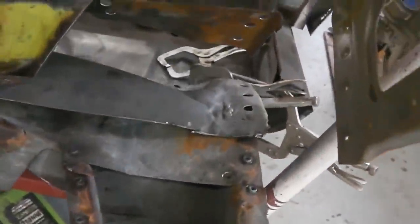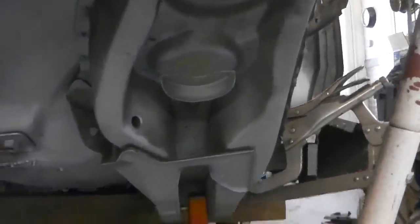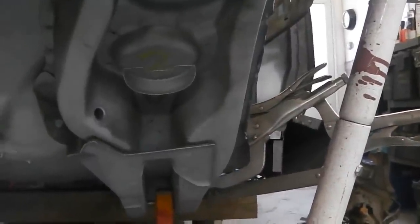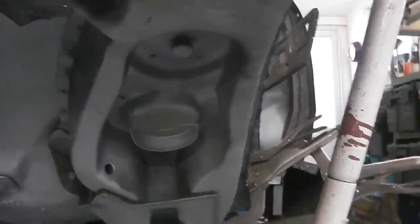We also start making preparations to attach the chassis leg, so that would need some paint on the inside of it. It wants to be nicely filled with paint. We don't need to go overboard inside, we just need to blast it full of paint because it's such a rot area. So rather than make it sheeny, shiny inside there, I'm going to leather it. It's only going to get filled with wax oil as well. So my OCD alarm does not continue to the point where it needs to be all shiny inside there. It'll be very clean. I'm not against it, don't get me wrong. I'm just saying for me personally.